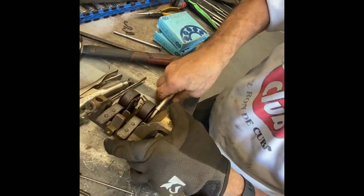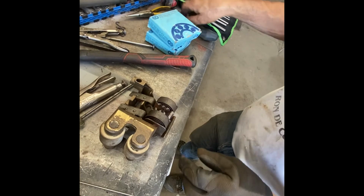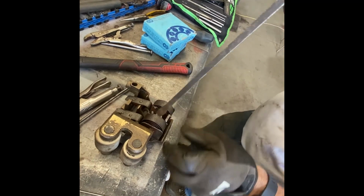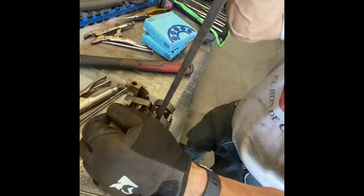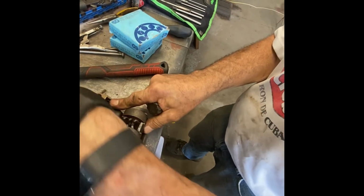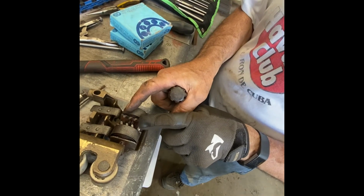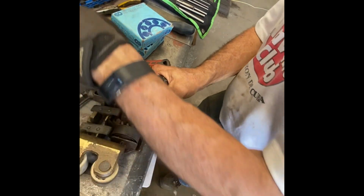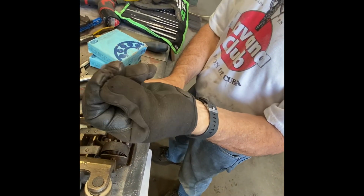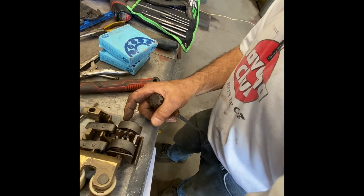From here on in, it's the same drill as before. But that's how you unfreeze a completely frozen one. You have to free off the cotter pins, file them flat, open up the side piece sufficiently that you can get movement. Same on this side, get the springs to move. Once the springs move, you can line the pins up to where you can get them. Try and tap them out if they won't come. Judicious heat on there with no pressure on the springs, because otherwise the heat will cause them to distort like that. We can straighten those out, but it's better if you don't do that. And then once this is done, you can take the pins out the same as the others so that they come out like that. Okay.